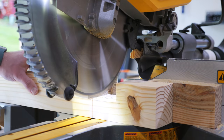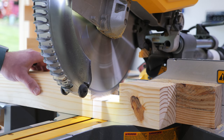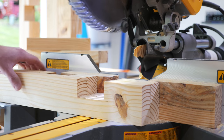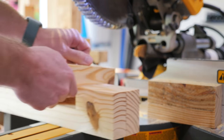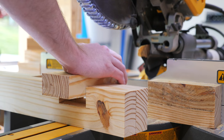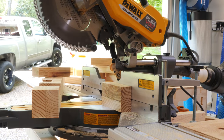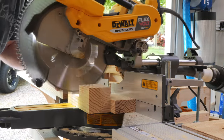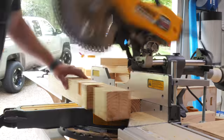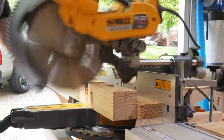When I got the bulk of the half-lap cleared out, I ran the leg horizontally across the bed of the miter saw, which is a potentially dangerous technique — really only try this if you're comfortable with it — but the resulting half-laps were super clean. I test fit my off-cut and found that the half-lap needed to be a smidge wider, and after making another pass I ended up with a great fit. I repeated the same process on the other three legs, and I ended up lowering my depth stop just a bit to make sure my stretchers were totally flush with the legs. I also found that I needed a little bit more distance from the fence to get an even depth across the entire half-lap, so I just laid those scrap spacers down, and this worked great.